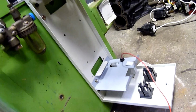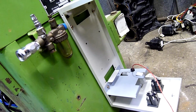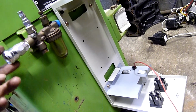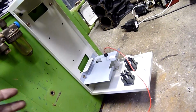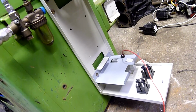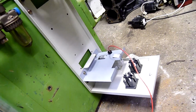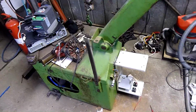It's only running for 30 seconds at a time, and then it's got a bit of cool down time, so it's fairly light duty, just a fairly high torque motor. So I'll keep playing with the VFD torque curve on it as needed, but I'm more interested in toning it down so it's a gentle start off and then torque ramps up after I've actually got the tyre lever under the bead and everything's sweet. Because this could be a bit of a handful under normal power. When I was running it on three-phase, you'd get times when it was slipping on the rim or it was causing other problems, and you'd wish you had some kind of torque limiting or torque control or ramp up. And this does it. It's actually really handy.